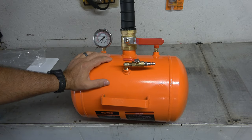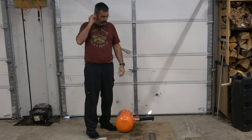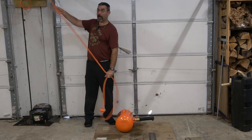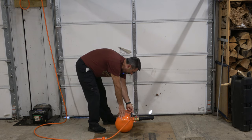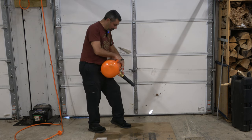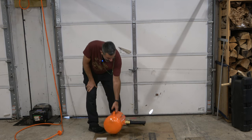I'm going to put some hearing protection in, some eye protection in, and we're going to test this out a couple of times. This will deafen you pretty quickly. I'm surprised at how little setup there was — I like that. We're going to go ahead and put some air in it, about 85 PSI. Now the proper way to do this is you kind of support it. Moving this slowly you hear how it starts to come out of there. That's not going to get the job done — when you do this you have to do it pretty quickly and it takes some practice.